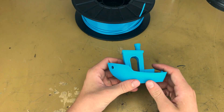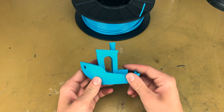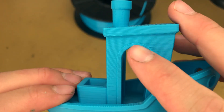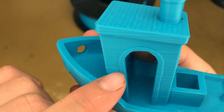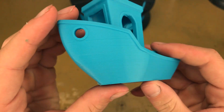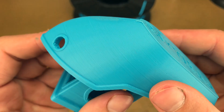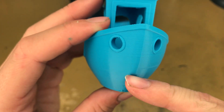The first thing I printed with this filament was the 3D Benchy. This Benchy turned out awesome. Close up, it looks awesome. The overhangs are relatively good. Right here there's a little bit of under extrusion — don't really know why that is, but it's okay. And the overhang right here, it's okay, it's not the greatest, just a little bit of layer wisping there.